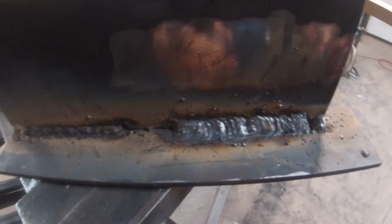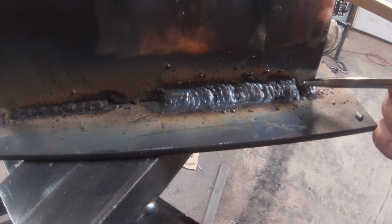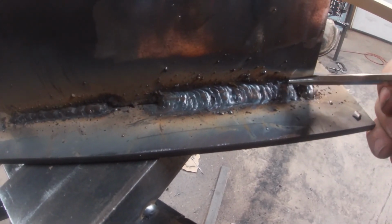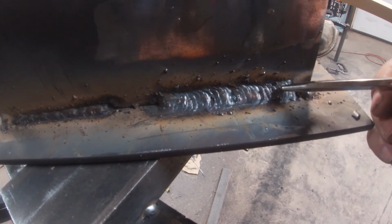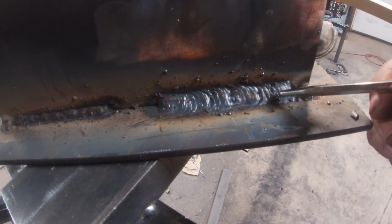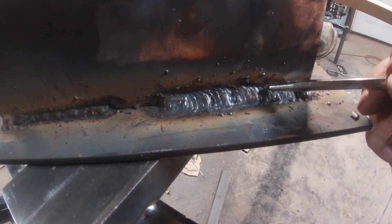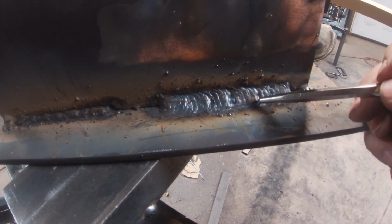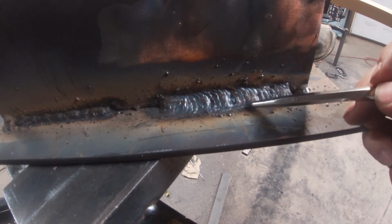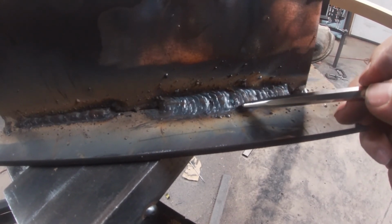And the next one we did, as you can see, is the vertical weave. We started down here, and we got it built up, and we got it going side to side. As you can see, those layers are only about a 1/16, maybe an 1/8 of an inch apart. So they're very close. And that's all you're doing. You're just kind of doing some V's. You're staying very close. Your stick action isn't very gradual, and you just keep going.